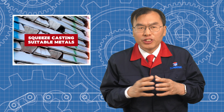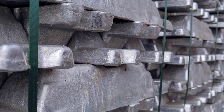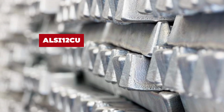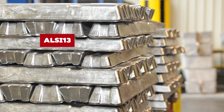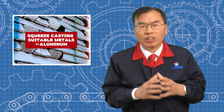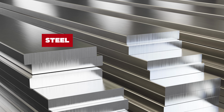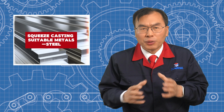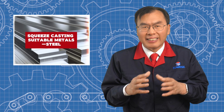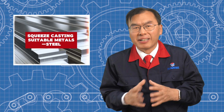Squeeze casting is commonly used with non-ferrous metals, especially aluminum alloys. Typical alloys include ADC12, A356, aluminum silicon 12 copper, and aluminum silicon 13. These materials flow well into the mold and respond nicely to pressure during solidification. Steel can also be used, but it depends on the specific alloy, the part shape, and the equipment. For some high-strength steels, squeeze casting can be a great option, especially when you need strong, dense parts with tight tolerance, but it does require more control over temperature and pressure.